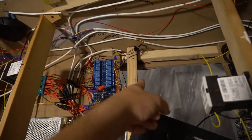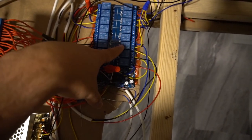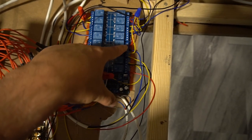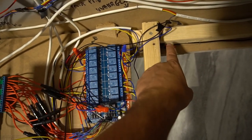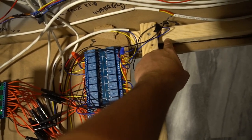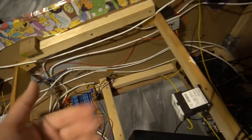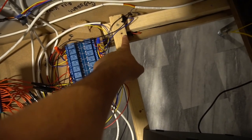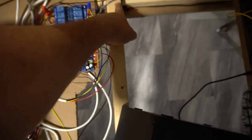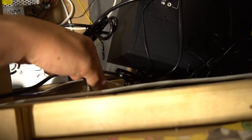Now, Vic, how do I fire this strobe off? You're going to go to your channel. This right here is one wire for the strobes. Basically, there is a daisy chain on it. Positive wire going to the strobe, then you splice out and go to the next strobe. Like for my table, I have a strobe in the middle left and I have a strobe in the middle right. That means I have a wire going from here, positive, to this positive.